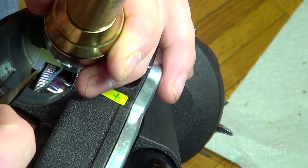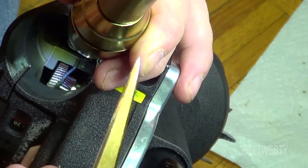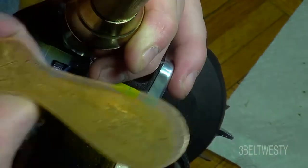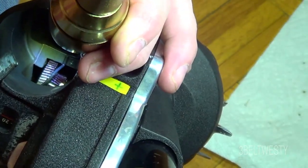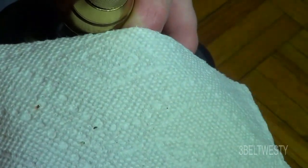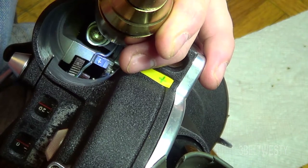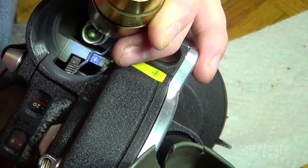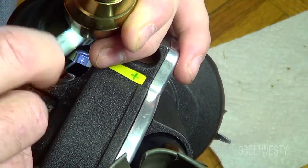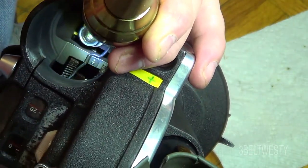On this gear there were little pieces of film chips, and I was able to go through and just pull them out. They stuck to this Clarence O'Brien letter opener and I was able to get out a whole bunch of them. On the piece of paper here is probably just about a third of them — I had probably a dozen little pieces of chips. Technically this unit needs to be completely overhauled, but that's the reason why the torque seemed to vary.